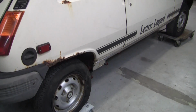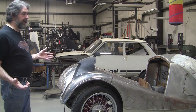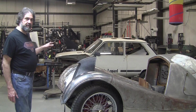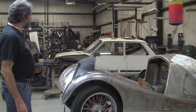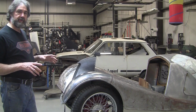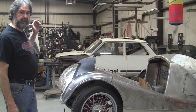So he's got a Tesla drivetrain that he's got lined up to purchase, and it's going to have a tube frame inside it. Basically going to have to gut it out inside, and it'll go from, I don't know, 58 or 68 horsepower to 250 horsepower. So it should be a screamer. And he's addressing a lot of the rust. The unibody in the front, the chassis pieces have a lot of rust in them, and I really counseled them to do a fresh build on it. If you want the ultimate Renault R5 but electric instead of a piston engine, make a tube frame out here using that as a measuring tool. That's what I do with all my student build projects.